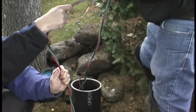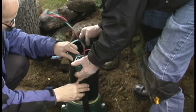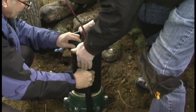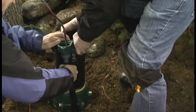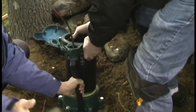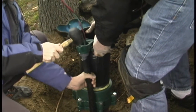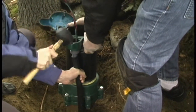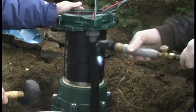We're going to thread the nipple with the wire — that's the wire from the house coming up. We've threaded the inner base of the cap with the pump wire. Now we've got to insert that nipple into the conduit tube. We heated it up a little bit because it was a rather cold day, and it just went on so nice and easy. Most of the time it goes in without any heat.